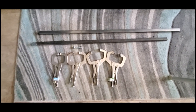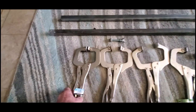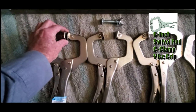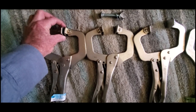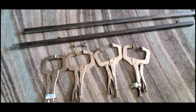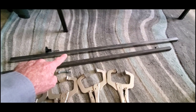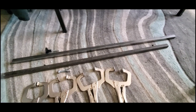The back-and-forth and side-to-side movement has to do with this frame. Don't run away yet — this is simple, easily bought off the shelf. I picked up hog nose vice grips at Harbor Freight. They were on sale for three or four dollars a piece. It's important to get the ones that have a little bit of a swivel right here — it'll make it flush up nice. All of this hides behind the easel and is hardly even noticeable once it's installed. This is one-inch tube steel, 16-gauge thick wall. You can buy this at Lowe's, Home Depot, and I think Harbor Freight might even carry some.